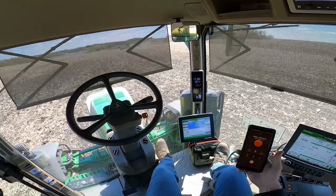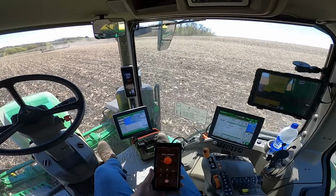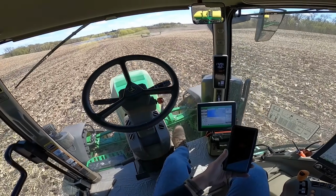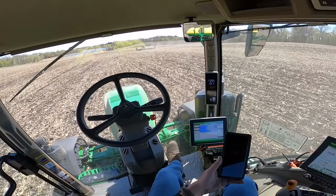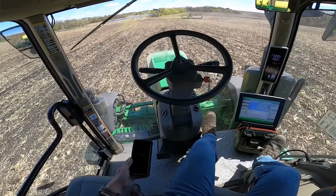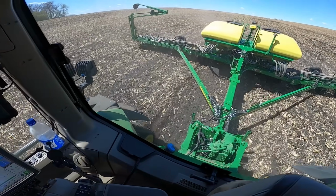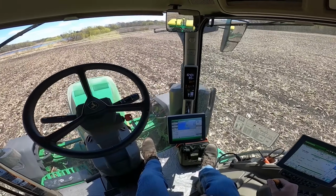Hello. Hi there. Hi. See, the 9560 is making a pretty funny noise. Uh-oh. Yeah, it's kind of scary to me. If I'm not pulling hard, then it doesn't make any noise. But if it starts to pull a little bit, it sounds like a gas engine with a lifter, only it's like a flatter sound. You know what a race car sounds like when it comes in ticking. I do. So it's not a hydraulic whine. It's in the engine. Or hopefully it's in the fan or something up there. That's my hope. You want me to run over there? But Tim's coming out.